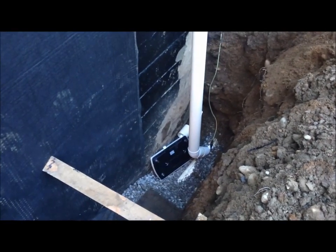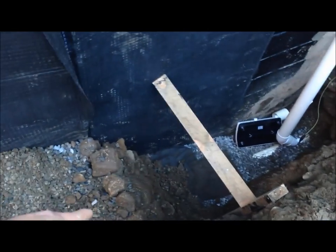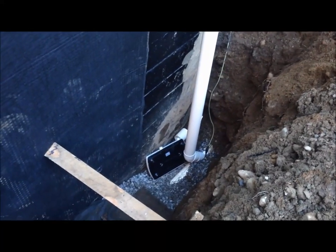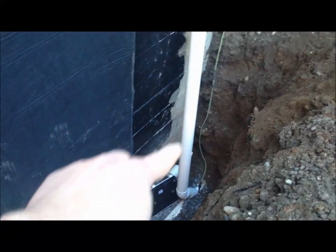We set up that burner just to dry it more quickly. Then he's put drain tile all the way through here and connected it properly over on that side, so this is all ready to go. What he's going to do is, when the cement is dried, put more gravel in, lay the fabric cloth all the way across, and then we'll paint waterproof the remaining bit of wall which he exposed this morning. And then we'll add some more waterproof membrane and then we'll fill this thing up.